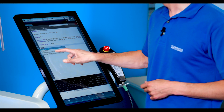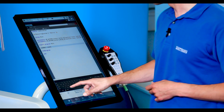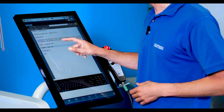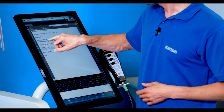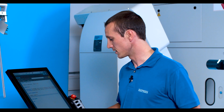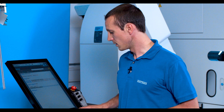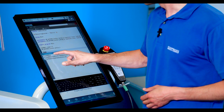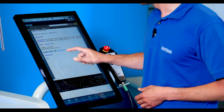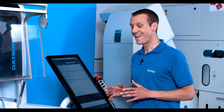So the first command would be 'load WCS', hit space — the name is already the next suggestion — and my first WCS origin is called 1. I'm calling this up, and now I use the name '_datron_cutter_setup_1' to call a sub-program as a reference. Then another 'load WCS', name and number 2 — that's for the second operation — and same thing here: setup 2. And that's it.